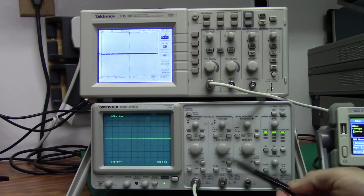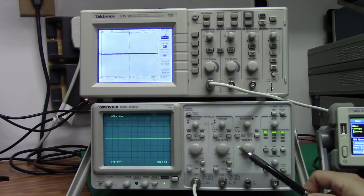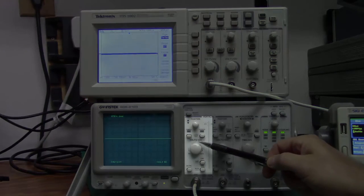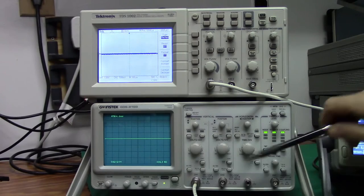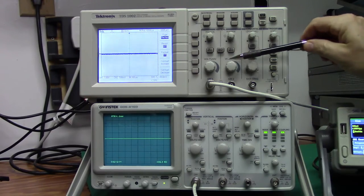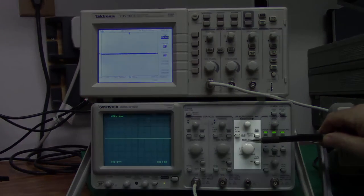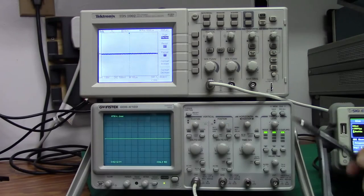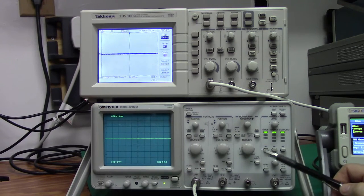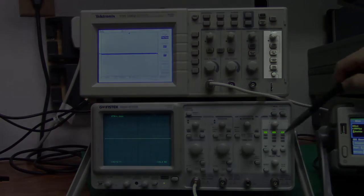And you can see that on these two oscilloscopes, both of them being two-channel units, there's a vertical control block or a volts division block here, and it's laid out almost in an identical fashion, positionally, with this unit. They'll have a horizontal block, which is the time control block, and they're pretty much laid out identically there. The last block tends to be the trigger block, which determines when the signal is going to be read by the scope and then how it's displayed, and you can see both of those here.